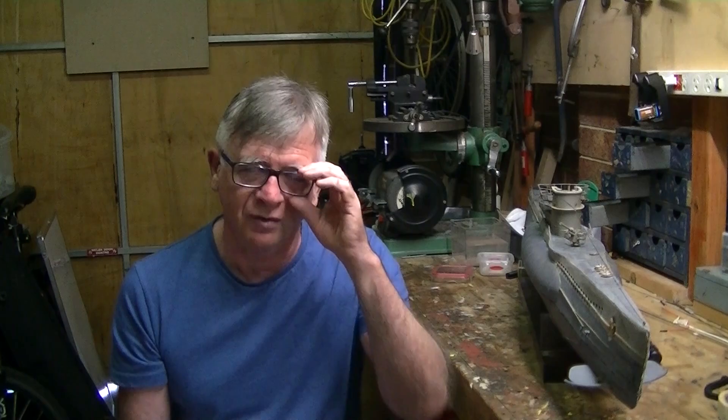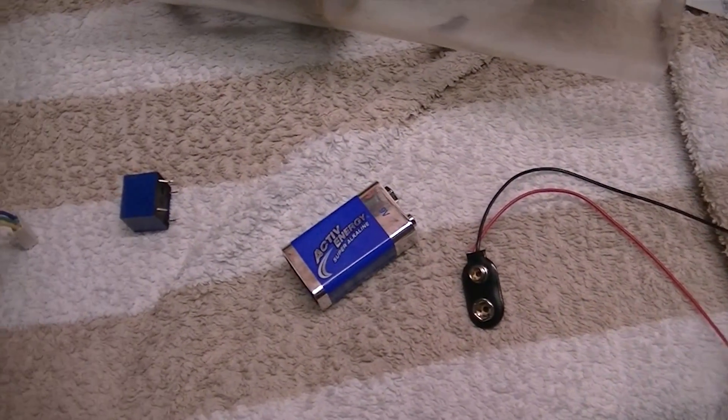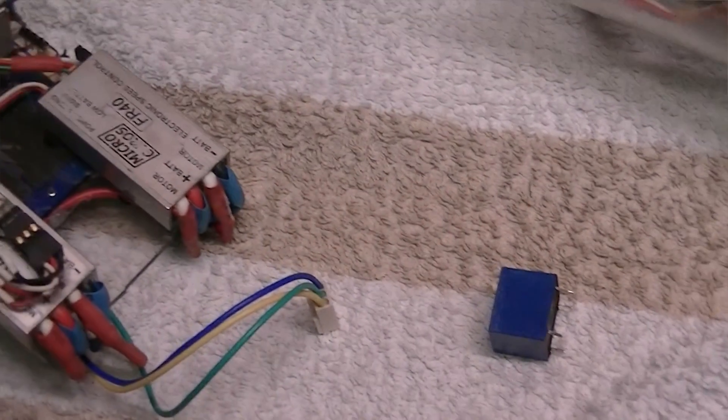One of the things that happened is I got rid of my old radio unit and bought a nine-channel radio unit, which simplified a lot of the code inside the boat — a real plus. For submariners, we need 36, 40, or 72 megahertz low frequencies to go into water, since 2.4 gigahertz bounces off water. I found a nice nine-channel unit on eBay and it's working much better. I also discovered I needed a completely separate 9-volt battery to run the Arduino, not connected to anything else — no surges, just running the Arduino on its own.